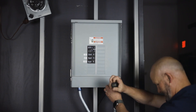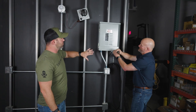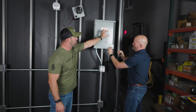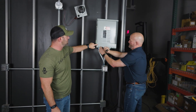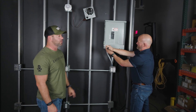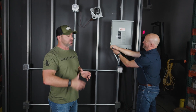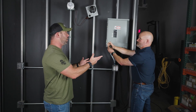In most panels — this one will look a little different than your house panel but it's very similar — there's usually a little cover that opens up, and there'll be screws you have to take off to remove the dead front or the cover. In a commercial application there's a cover and a dead front; in your house it's all one piece.